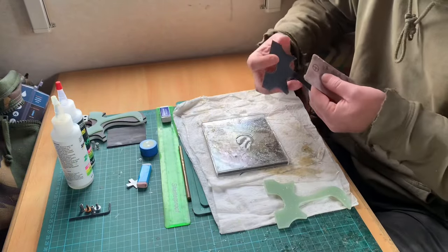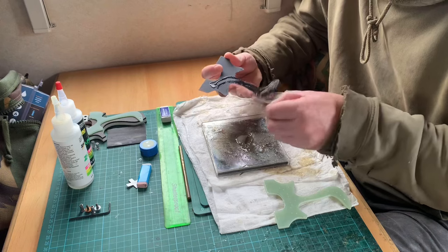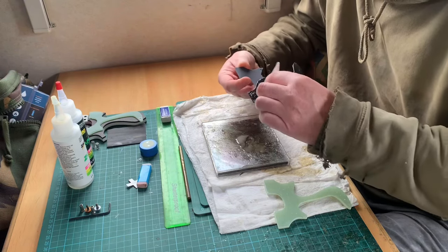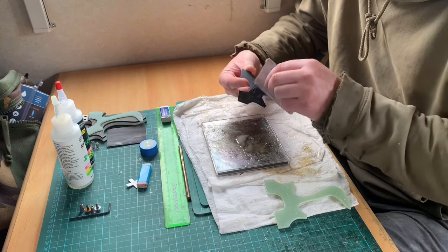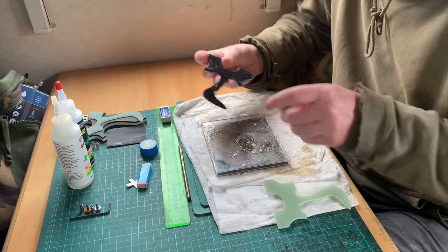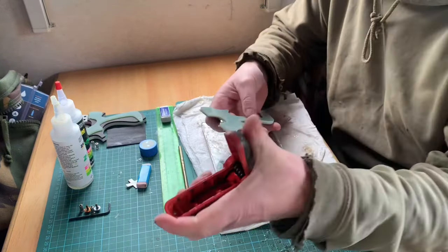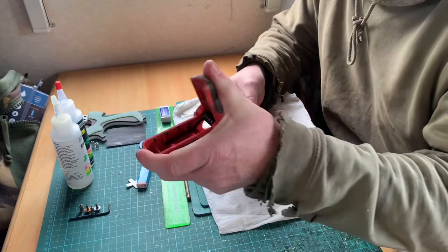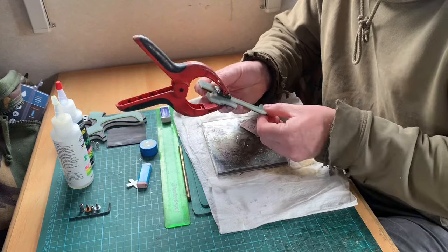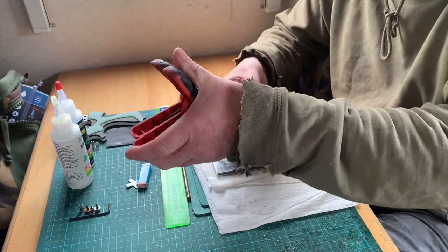First one done — make sure you glue the right side. This is why I always oversize a little bit, because it makes it much easier to glue up. For clamps I use spring clamps — I don't like solid clamps; they don't work for me. Spring clamps work much better although they do have risks because when you put them on they can slip and slide, so you've got to keep checking everything's where it should be. I get one on in the middle and then get the forks done — that should hold it all in place.